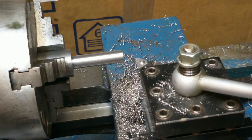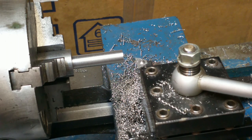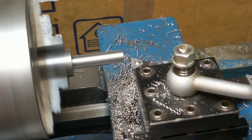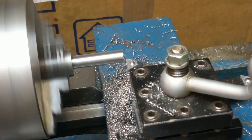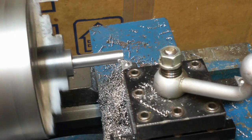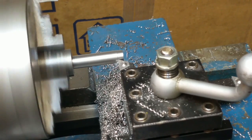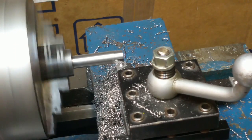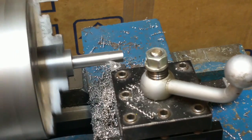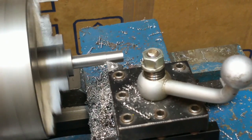So we're at 90 now. So we'll go into 5. So 90 to 0, and then to 5. That's 15. And then that should get us close. So here's a 30 thousandths pass. Noticeably nicer surface finish, just going from 40 thousandths to 30 thousandths. Of course, we've still got a feed rate that'll get us 160 threads per inch, so it's not going to be the greatest surface finish anyway.